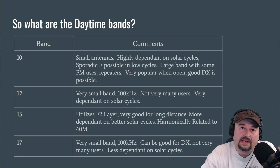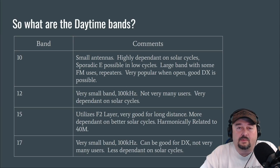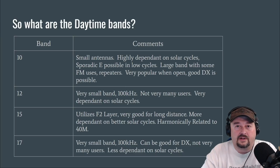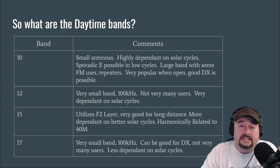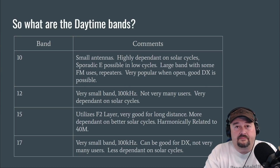Let's take a few minutes to talk about the different bands and their characteristics, working from higher frequencies down to lower. 10 meters is the first — what's unique about it is that the antennas are small, but 10 meters is highly dependent upon solar cycles. I got my general license back in the last solar cycle when there wasn't a lot of solar activity, so 10 meters didn't work very well. I built a 10-meter dipole thinking I'd make all these contacts, and it didn't work out. But things are changing with the new solar cycle. I'm encouraging everybody to build a 10-meter dipole — they only have to be about five meters for a half-wave, so it's a small antenna with a small footprint.